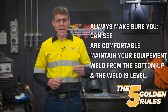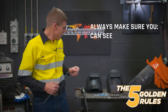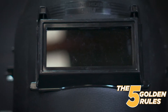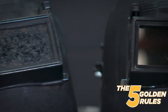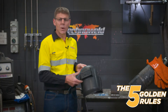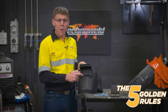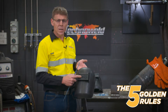Making sure you can see is a really important part because if you can't see, you can't weld. If you have a helmet that's covered in spatter and you can't see through that lens, how can you expect to get a nice clear view of the weld pool and produce a weld that is as good as it can possibly be? So before you start welding, get your helmet, make sure the cover lens is in place, and the dark lens is in good condition and clean.